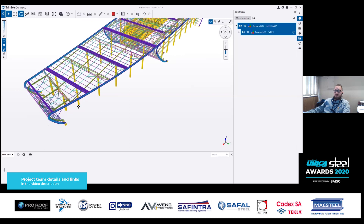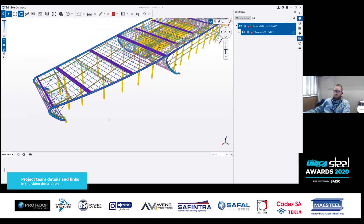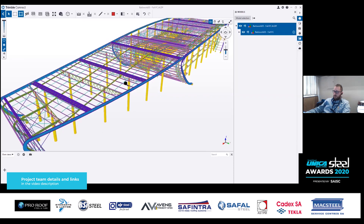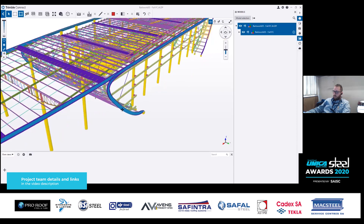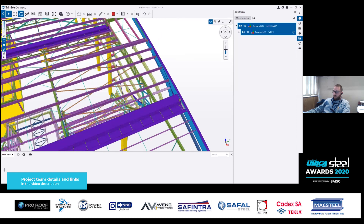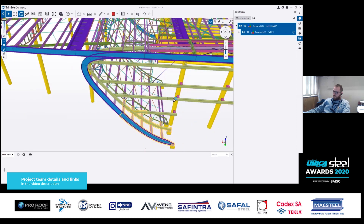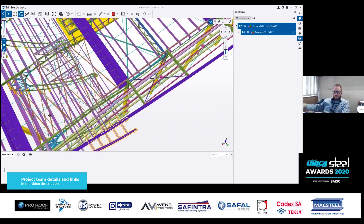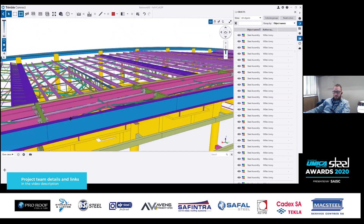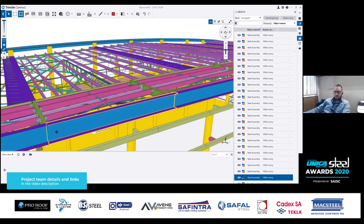Can you go into a little bit more detail on your challenges and how you overcame them? All these curved sections were drawn as flat plates and then either bent or cut. The top sections were drawn as flat plates but curved slightly on top, and then the bottom sections of those girders were drawn as flat plates. When we welded them together, we kind of pulled them to the right position to get the curve in two planes that we needed.